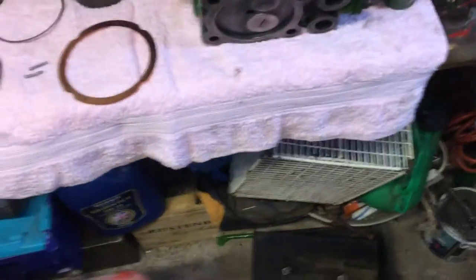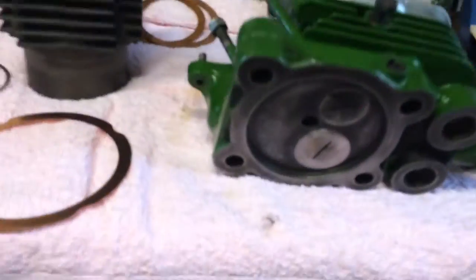It's always a good idea to get these manuals. This particular engine I'm going to look at now is a Petter PC1. The bump clearances for this engine — you can see it's not focusing very well — but they're basically between 24 thousandths of an inch to 28 thousandths of an inch. That's the clearance between the top of your piston and the bottom side of your cylinder head.